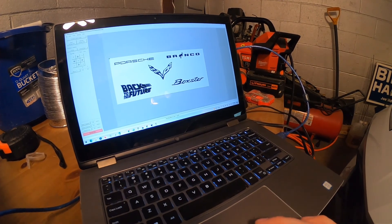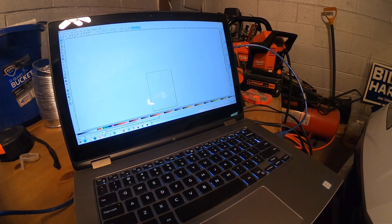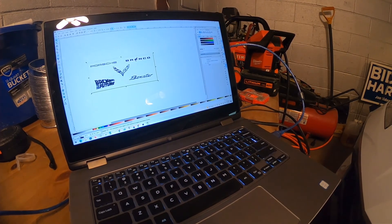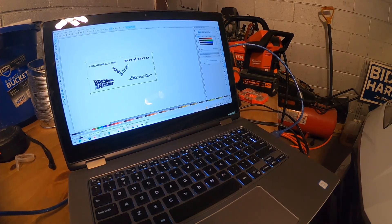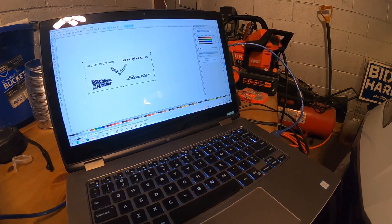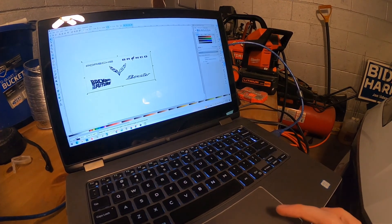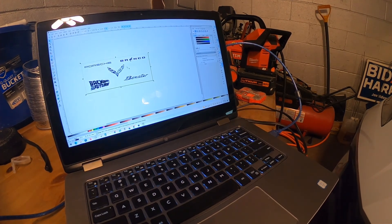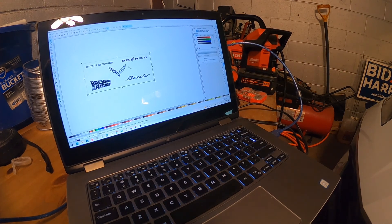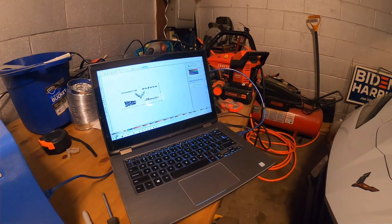The other application you have to use is called Inkscape. You take pictures or images, bring them into Inkscape, and convert them into SVG files, which the K40 uses. For the raster engraving, the file has to be black so it knows to do raster engraving. If you change the color to blue, it'll do a regular outline engraving with the laser. If you do red, that's an actual cut — it can cut through thin materials like eighth-inch acrylic or eighth-inch wood.